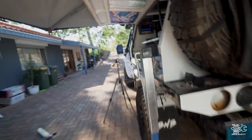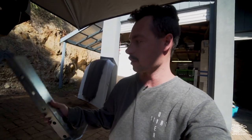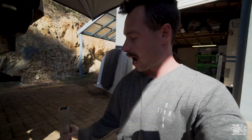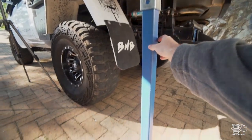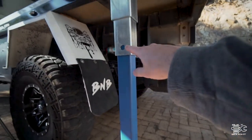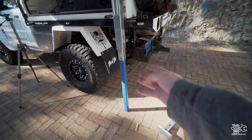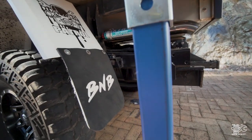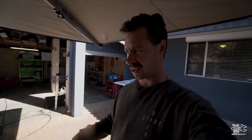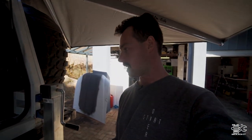So I've got all the legs sorted out — got that one made, and that one, and that one. The next thing I was going to do is extend these bottom legs using some 50 by 50 — basically cut a piece, extend it, weld it, and drill some new holes. But I had a brainwave: instead of welding halfway through, I'm going to use a whole new length — cut the bottom footing off, grind it back, and re-weld that footing onto the new bar, drill some holes. That means the new one won't have a weld halfway in; it'll be a full new leg piece. That means I'll need to get some more steel, so I'll get two done today and two more when I can get the steel. Then it's cleaning these up, spraying with galv spray, drilling the big holes for the pins, and we're pretty much there.